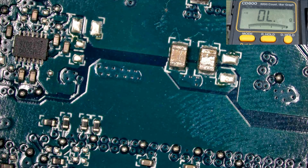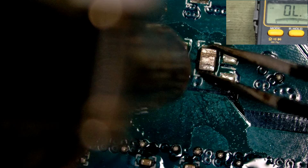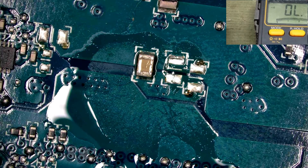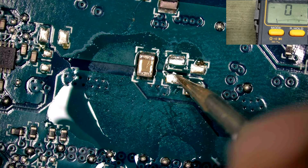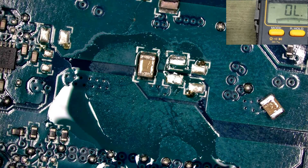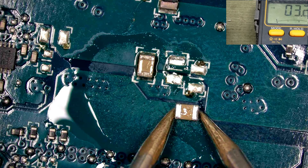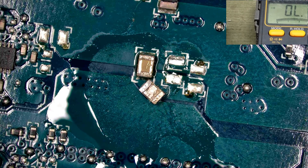Okay, capacitor is open. Check it — is it short circuit or not? This one is ground and this one is okay. Now the short circuit is open. This capacitor was the faulty capacitor. Again I measure this here — and this one is short. Hopefully our circuit will be okay. And this capacitor is shorted — there is another one.